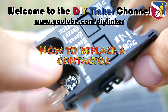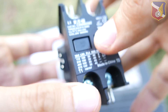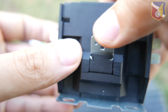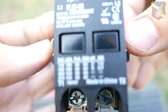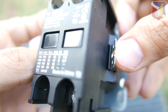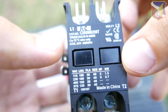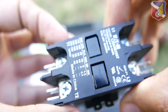I'm replacing the contactor. Just a quick intro to explain how the contactor works. The 24-volt AC signal goes through these two pins right here. Once the thermostat is turned on and calls for cold air, it will energize these two points. There's a coil in here that gets energized, and that coil will then engage the contactor, completing the circuit.